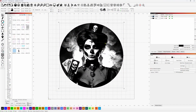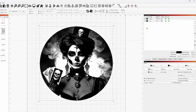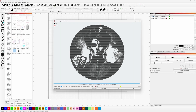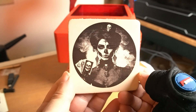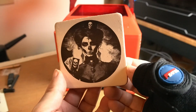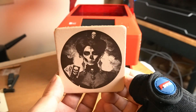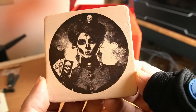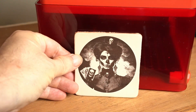I had a simple time installing the machine into Lightburn. We're going to engrave leather here at 7,000 millimeters per minute and 60% power — it says it's going to take 13 minutes and 5 seconds. I like the way it came out. That's the nice thing about these lower wattage machines: they really know how to make the engraving nice and dark with minimal banding. Very happy with the outcome.